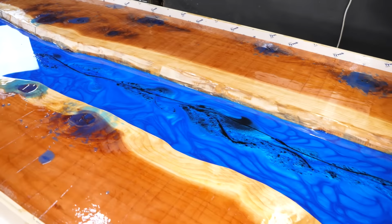Okay, I remembered what I was talking about. Flood coats, 3 ounces per square foot. We're going to use an 1/8 inch by 1/8 inch square notch trowel. That evenly spreads the material. It also mixes that material one more time as those teeth glide through the epoxy. Make sure to rub your edges with your gloved hands so an even flow happens as the material levels.